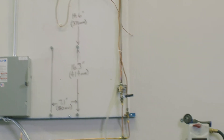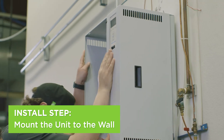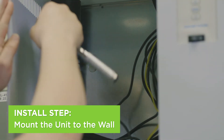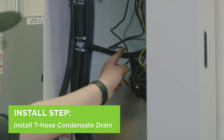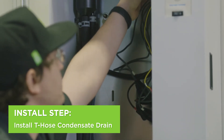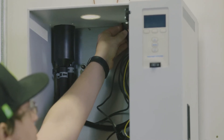We've already cut the feed hose from the fill cup to the drain valve and inserted our condensate drain. We've also knocked out the top port for that condensate drain to fit through. As part of the installation process, you're going to need to put a condensate drain from the steam dispersion unit back into the humidifier using the provided T and length of hose — just cut your fill line, install it, and attach the tube to the drain of your steam dispersion unit.